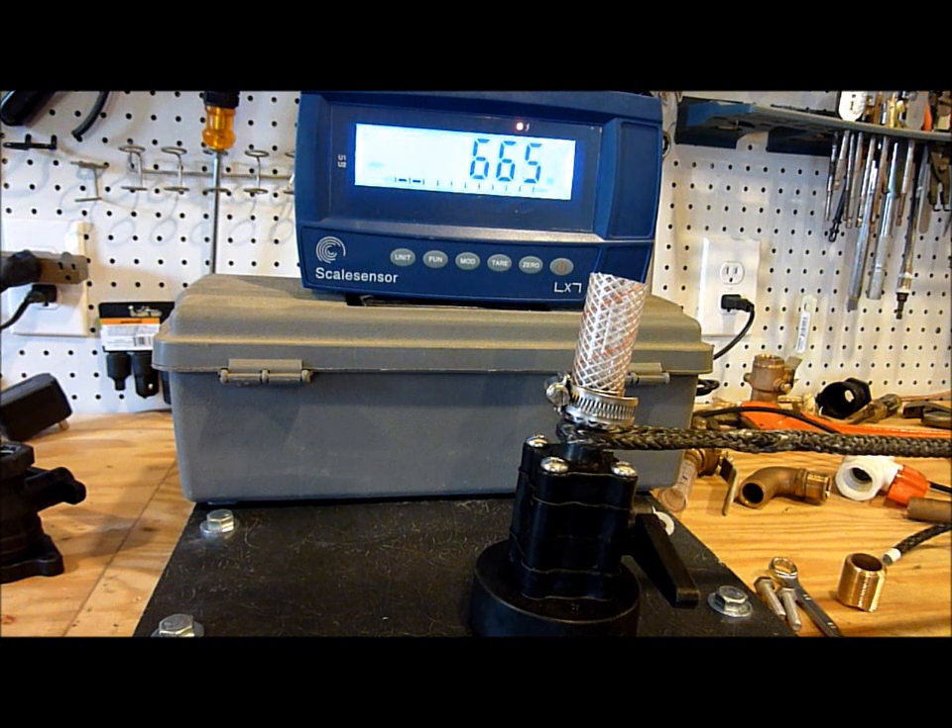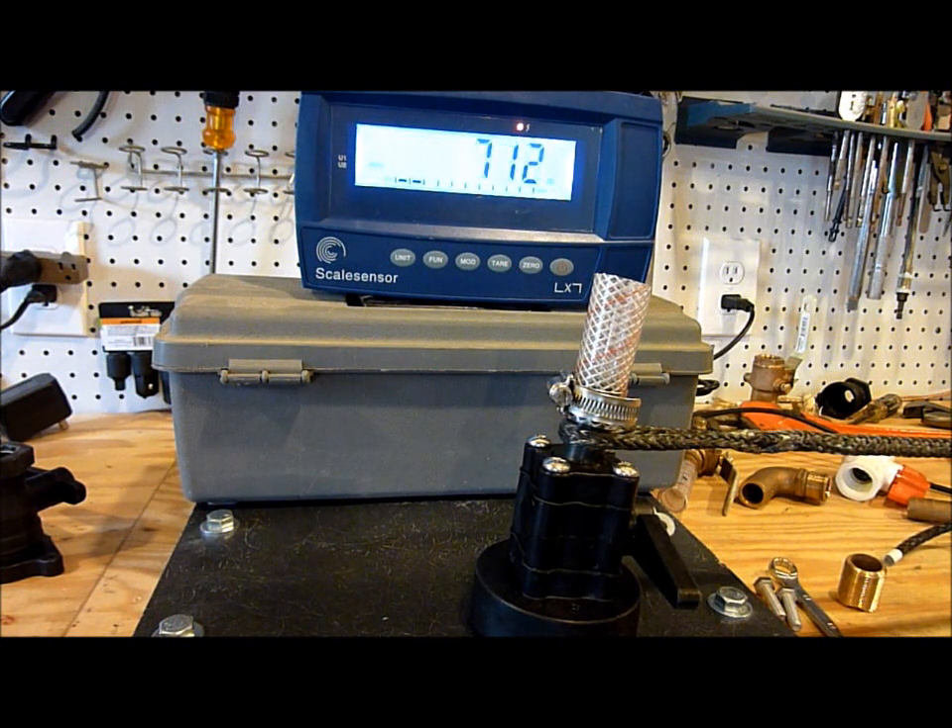She's taking it, she's taking the abuse. Again, this is the smallest size available in this valve, and we're holding it 150 pounds more than what the ABYC requires, and creeping her up over 700 now. These things are pretty bomb-proof.